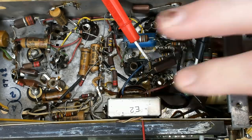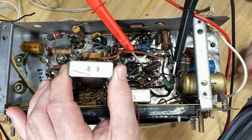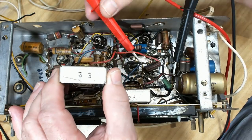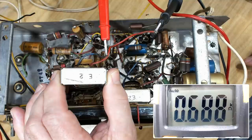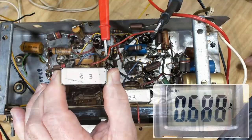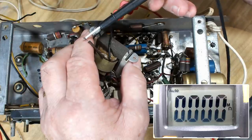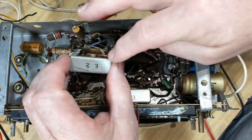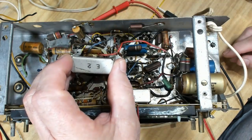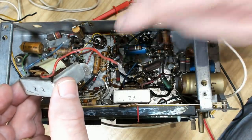I'm pretty sure I've got one of these chassis outside. I'll go and see if I can get a transformer off it. I was lucky enough to find another transformer, so I'll test it and see if it works. The meter shows it's working. I don't think I've seen one with an open secondary but I'll test it anyway. I'll swap these two transformers over and before applying power I'll test the circuits to find out why this one failed.